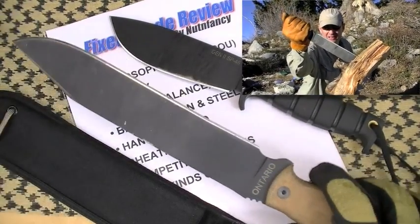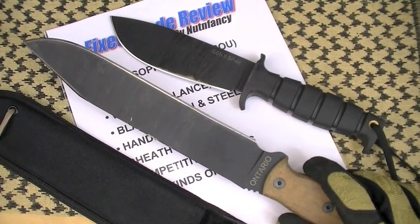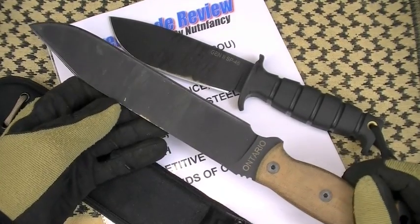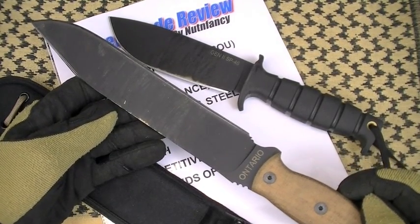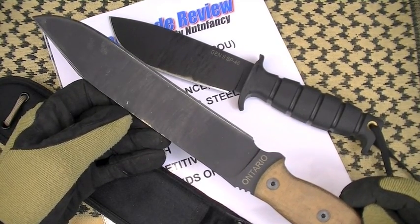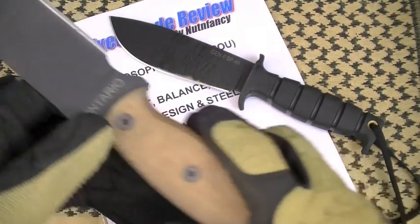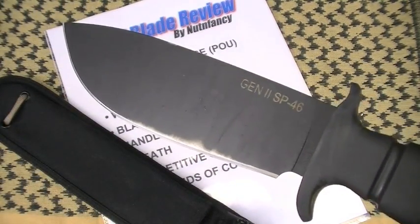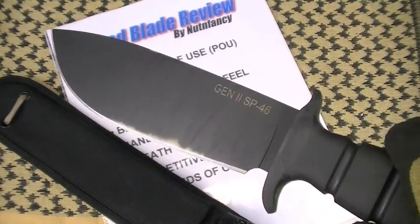It's supposed to be a hardened spring steel with a higher carbon content, ranging from my research 0.56 to 0.64, chromium content 0.7 to 0.9. Okay, but I have seen it roll. I didn't see it in the SP46. Granted, I haven't done days and weeks of testing on this knife. I got to tell you, I haven't.